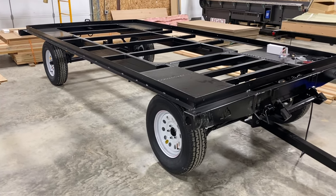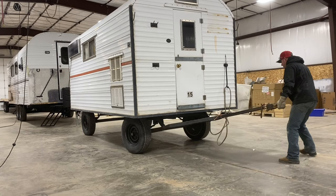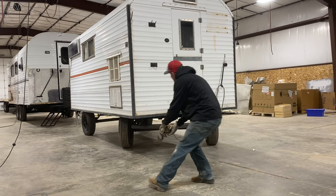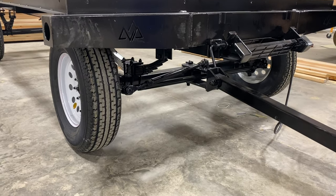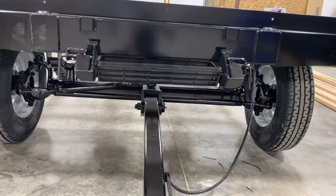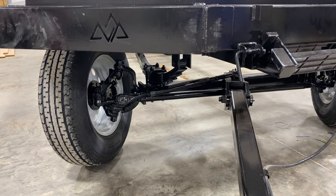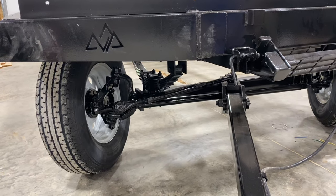We offer two different styles in this wagon setup. We do a fifth wheel plate, which means the whole axle will spin as you turn — a very popular option that tends to pull a little bit better. But the nice thing about this style is that when hooking up to the truck in rough ground, you don't have to turn the whole axle — just the tires turn, set up just like the front end of your truck. There are a lot of moving parts that have to be maintained, but it's definitely easier to work with than the fifth wheel turntable.